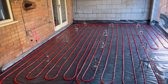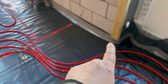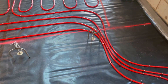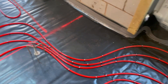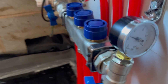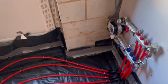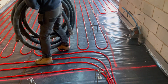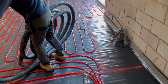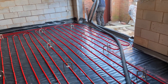My dulcet tones again — the radio was left on when Mick was explaining this. What he's showing there is the base of the stud wall where we'll be fixing the stud. All he's saying is we won't be screwing it down, just in case of any risk of puncturing the pipes or going into the membrane. We'll just glue it down. He's attached the hose and pressurised the system to two and a half bars — this checks his connections for leaks on the pipe, and also expands the pipes that will be in the screed to their maximum, so when the screed goes on top and it goes cold and contracts again, the pipework won't be in a smaller hole.